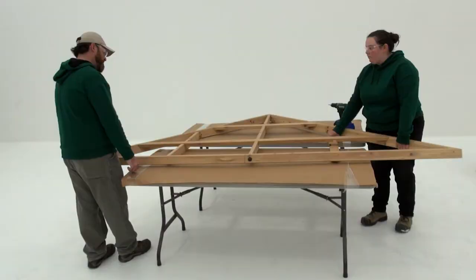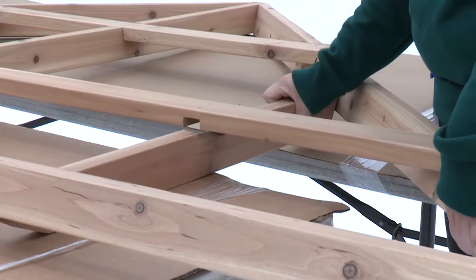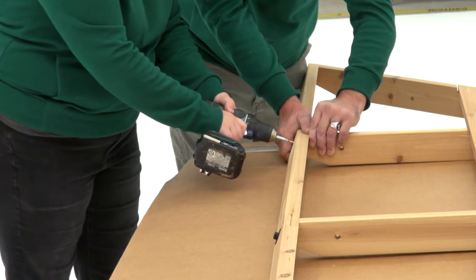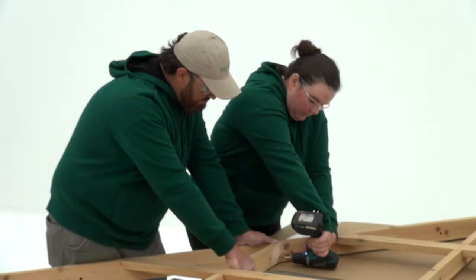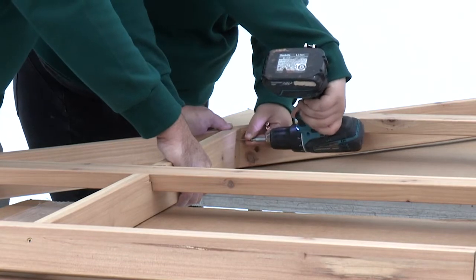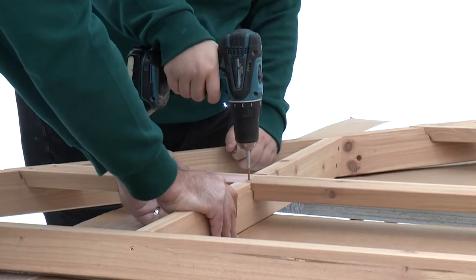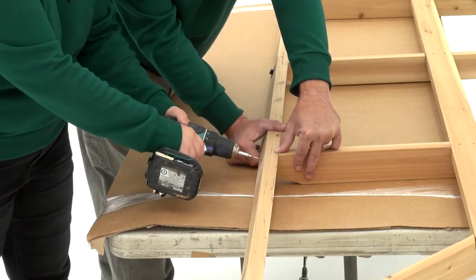Next, lift the assembly to position the rafter short left and rafter short right into the grooves on the strap long. Line up the end of the rafter short left with the pilot hole on the fascia beam assembly; when the boards are flush, attach with one wood screw. Hold the top of the rafter short left against the side of the corner LT; when flush, attach with two wood screws. Use two more wood screws to attach the rafter short left to the strap long. Repeat each step to attach a rafter short right to the assembly.